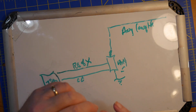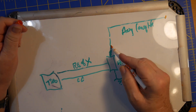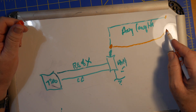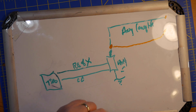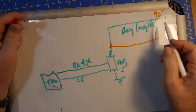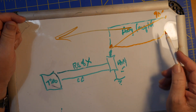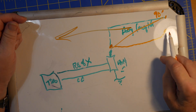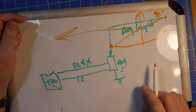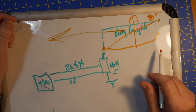What happened is this wire came down because it came out of the tree. So now he has from the top of the house this drooping thing like this. Before, he had 90 feet of height — it was a sloper, which meant it would mostly transmit that way. Now he has a low-to-the-ground antenna, so it's mostly going to transmit up.